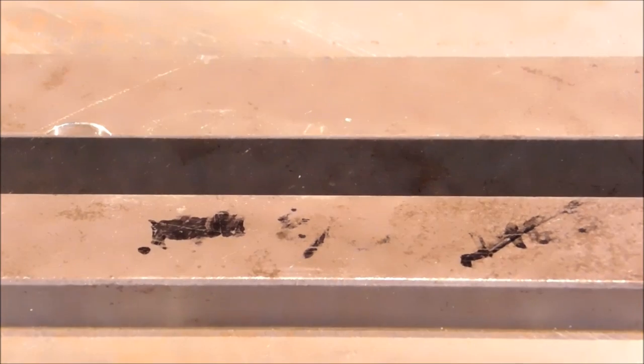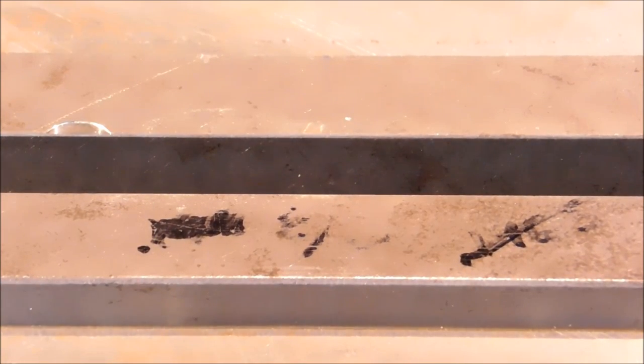Next step in the process is to put a couple of 80 thou diameter holes in the set screws or the flathead screws that I'm going to use. And just strictly to line these things up by eye, I'm going to use a gauge pin of the exact same diameter of the threaded part. And I'm just going to visually line it up side to side by eye. This is not important, and location should be somewhere below the conical feature of the screw.